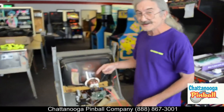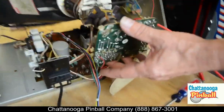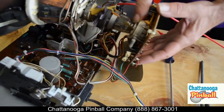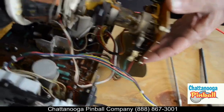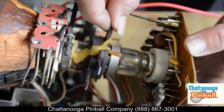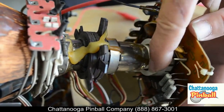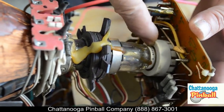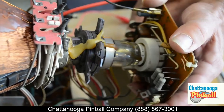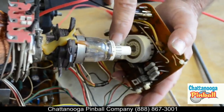That disconnects the most dangerous part, and from there it's pretty simple. We're going to disconnect the neckboard next. A lot of times when you go to pull this off, there'll be a big glob of either rubber-type cement or silicone to hold it in place. You can see some stripes from the hot glue used to hold the convergence rings in place. If you've got a big glob of rubber cement there, take a razor blade and slice across the top of this connector to break that seal, then wiggle it around to get it started. Pull it off as straight as possible because of the pins.